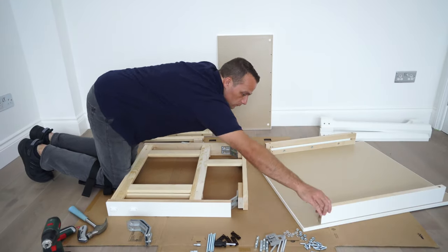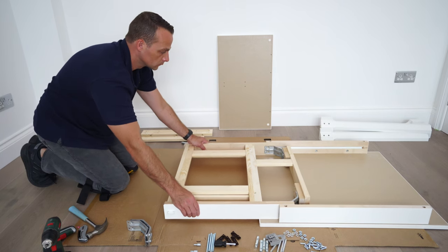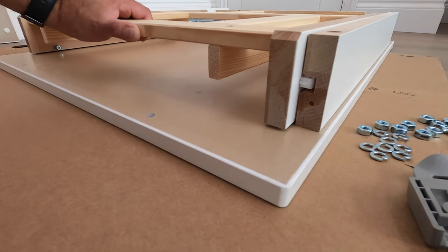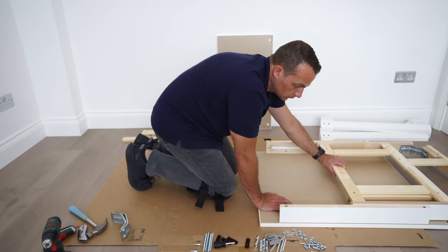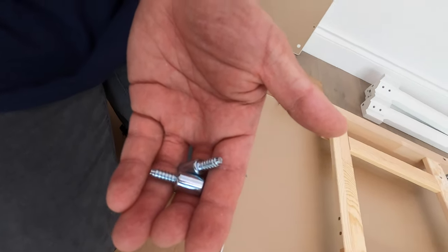Here we can position the top and slide the extending part into the rail. There are those plastics, they're coming into the rail on each side, so slide it in all the way. That's how it works in there. Lift it up slightly and we can go over, so we can place now the another part of the stopping screws.